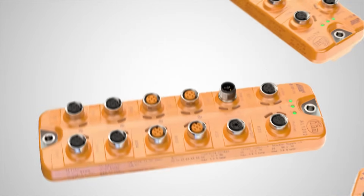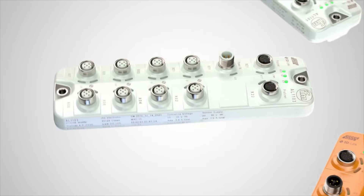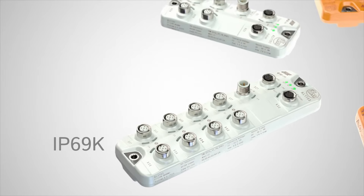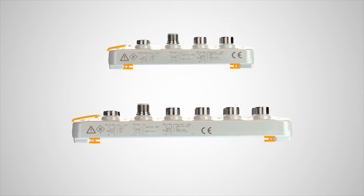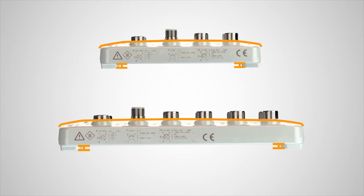In addition to producing IO-Link masters for industrial automation, a sanitary food grade version is also available with stainless steel hardware and rated IP69K. IFM's sanitary masters are designed with a mounting offset and convex front surface that resists material buildup and allows for thorough cleaning.